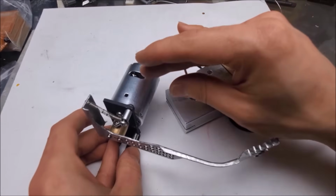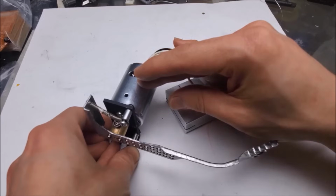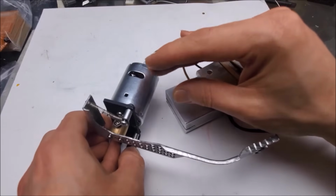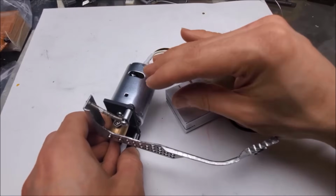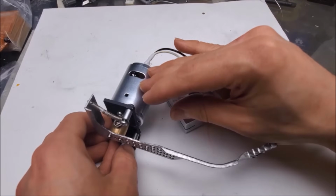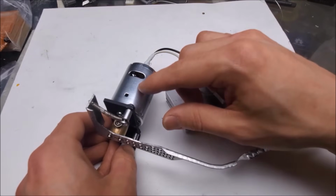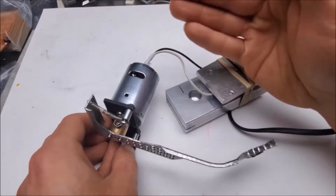Now, since this is a fairly large motor, it takes quite a lot of current when it's stalled, which isn't necessarily a problem in this application. So our real numbers are, we got about 1 volt in and about 4.5 amps going into it, so about 5 watts of heat generated, which in a package this size is next to nothing.